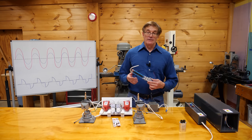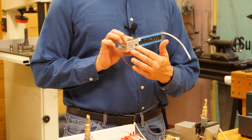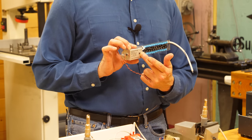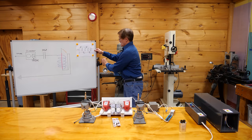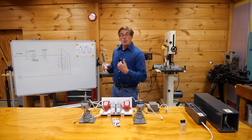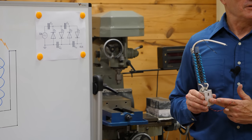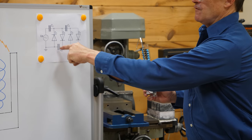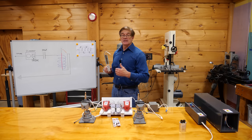One way to increase voltage is to use a voltage multiplier — a pretty interesting device. It's based on a little power supply made to energize neon or discharge tubes, and it runs conveniently off 12 volts DC. The output is 2,000 volts AC at about 10 milliamps. The way the voltage multiplier works is that based on the alignment of the rectifiers and capacitors, when the system cycles it charges all capacitors in parallel to the 2,000-volt transformer output. When they discharge — when the polarity reverses — they discharge in series, so the voltage builds up: 2,000, 4,000, 6,000, 8,000 as you go up the ladder. The output of this device is about 30,000 volts but at a correspondingly low current of microamps. It's super light because there's no iron core transformer.